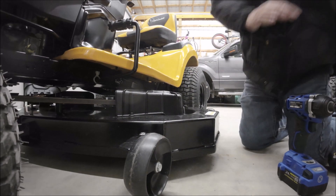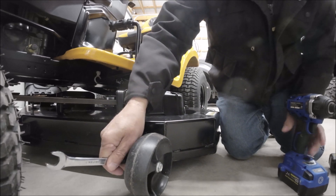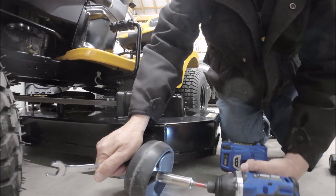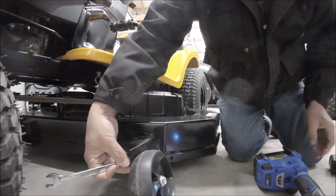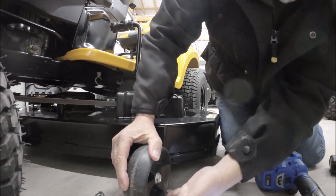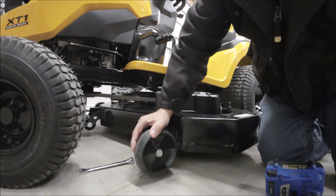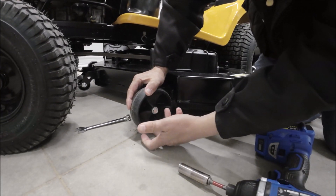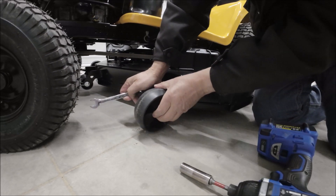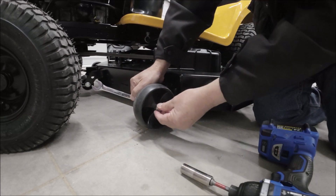What we're going to do here: we're going to take the first wheel off, put a wrench on the back side to hold the nut, put the socket on the front, and pull it and let the wheel come off. Now what I'm going to do — I'm going down. See there, there's just about a half inch. If you look — I'm trying to do this so you guys can see — there's just about a finger's width underneath there. So I ended up going down from where I was here to this hole in the front. Then we'll put the wheel back on.